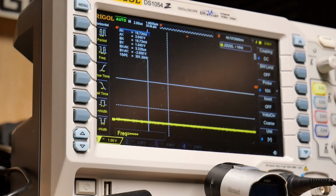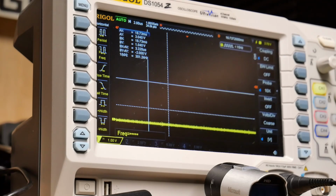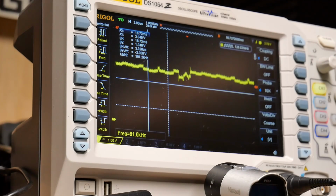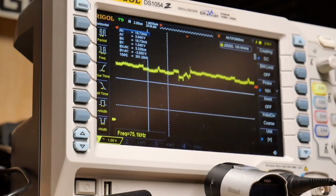It's on data bit 0, and I turn it on, and it basically goes to high. You see a little bit of weird activity. Okay, it was just for an instant, but it does go high. And yeah, even though it's a little jaggy at the top, that's fine. That's just because things are going on the bus with the CPU probably. But generally, it's held high, which is just what it should be doing.